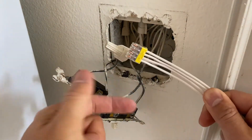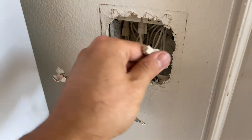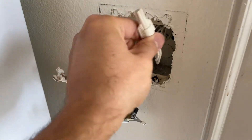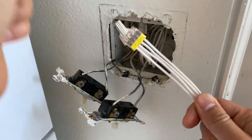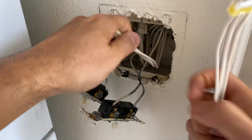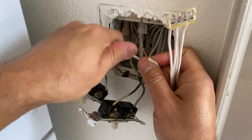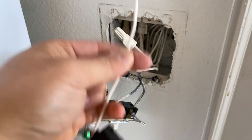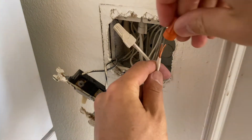What a lot of you are doing is — if you have a three- or four-gang switch you will have two separate circuits. You might have all the neutral wires connected together with a wire nut, or connected with a push-in connector. What a lot of people do is they just remove this wire nut, put the wire nut back on two wires, and use this white neutral right here. Then, assuming this is a smart switch that needs a neutral wire, they will just wire it directly like this.